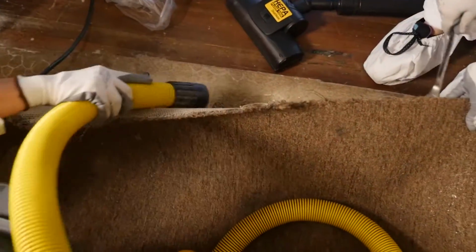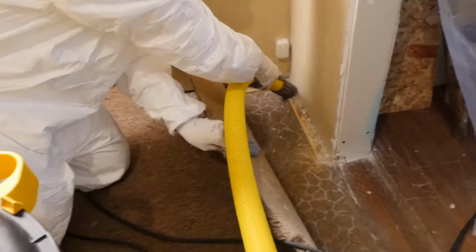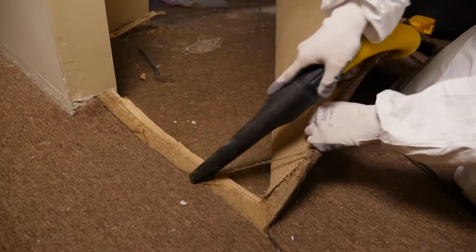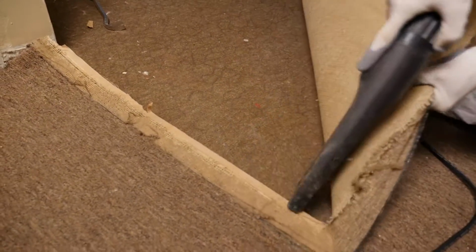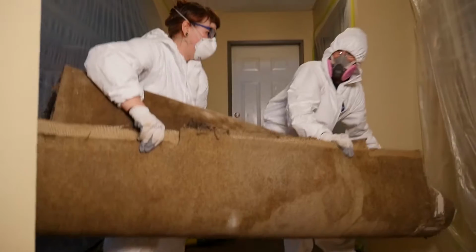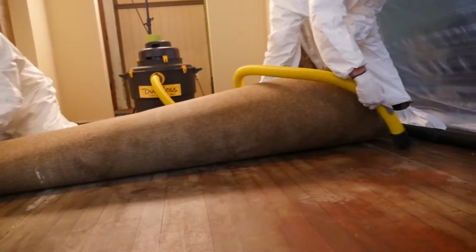It's important to be meticulous as you work because you will likely find lots of dust below the carpet or flooring. Misting the air helps keep any dust down on the ground where you can vacuum it up. Avoid dry sweeping or using regular vacuums as it stirs up dust. When you are ready to remove the flooring from the work area, you need to think about how to get the flooring out of the room for disposal and whether you will try to remove small pieces or larger intact sections. Both options have simple lead-safe solutions.